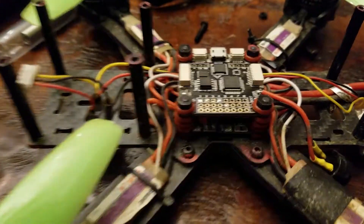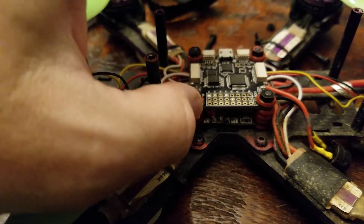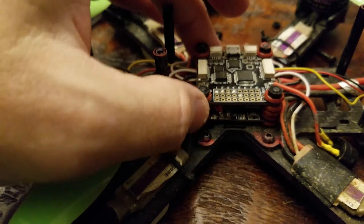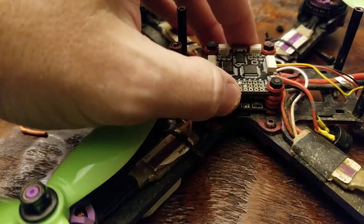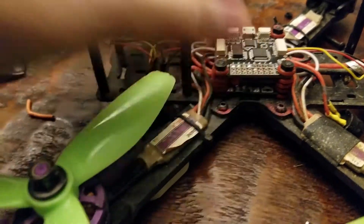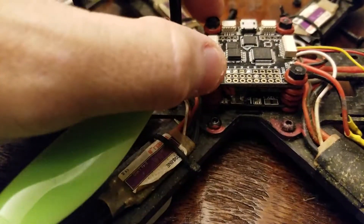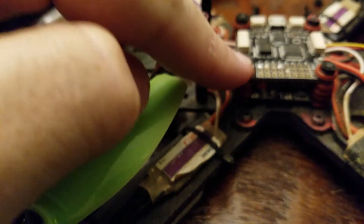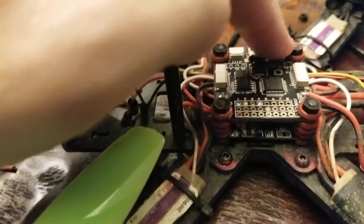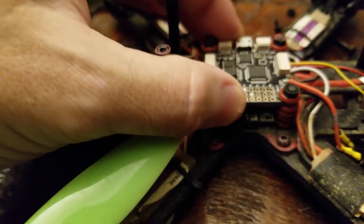Here's the completed stack — it's just nylon, a total of five bushings per mount point. I've also seen where you can use plastic surgical tubing, a rubbery surgical tubing. I used the grommets because I bought them for something else, and I might switch it out one day. I tightened down and just put a drop of nail polish, like I did there, to keep these from vibrating loose.